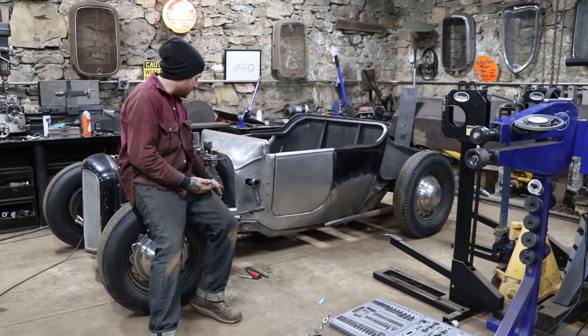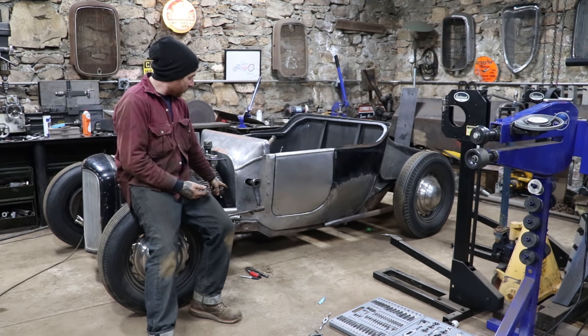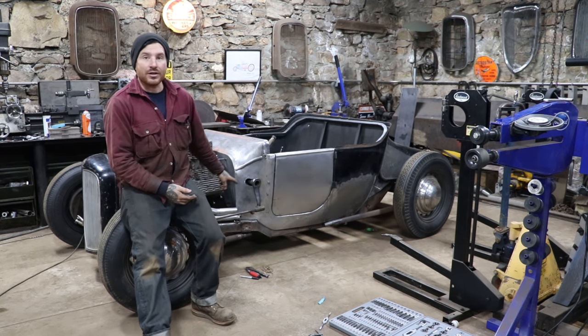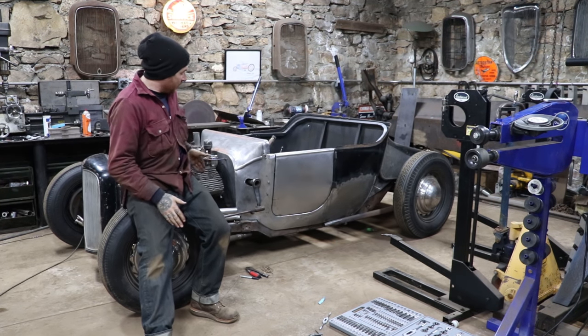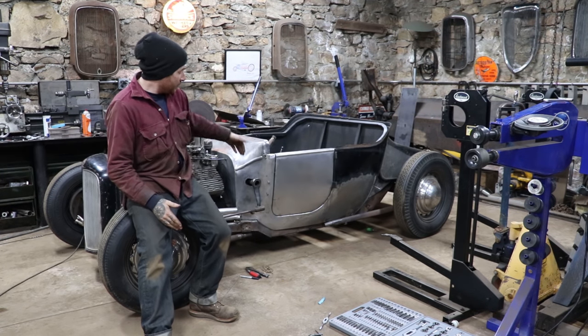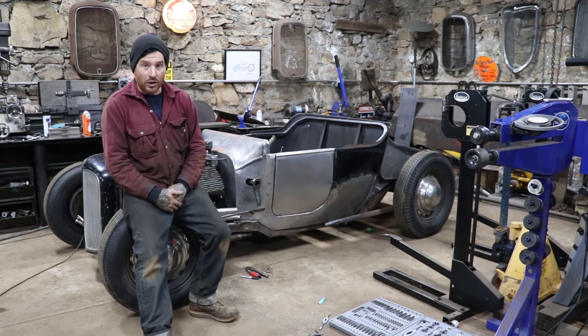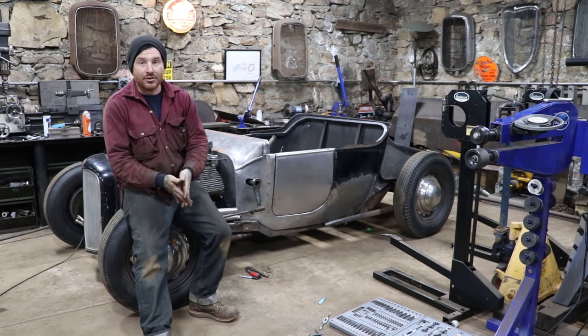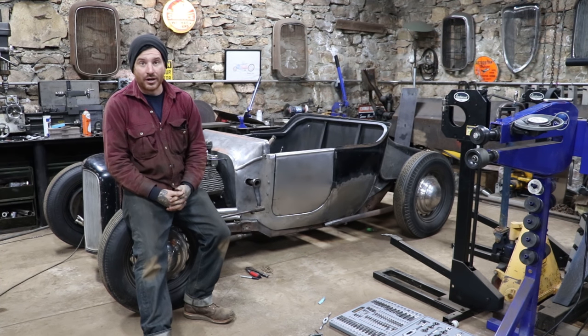What we worked on is he got a bend going in the back here, and then we did a pretty cool idea for the merge in the back where the front and rear cylinders are going to merge together. We actually need to bend the pipe out just a little bit because the body obviously gets wider, and then we need to drop it down to get it below the door. So we're merging everything together right there. It was an idea that I had, but we weren't quite sure if it would work, but it actually ended up working out pretty well.